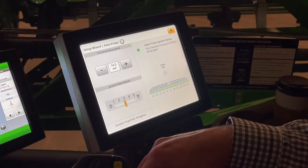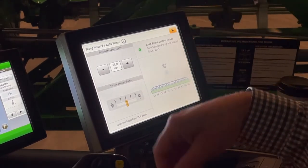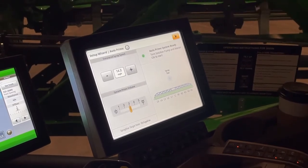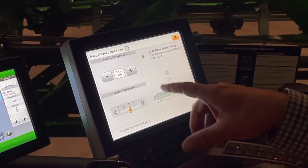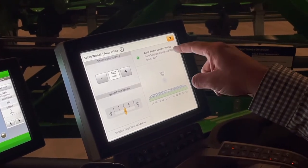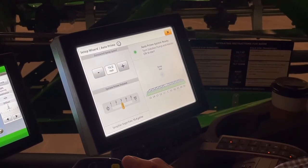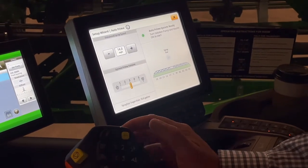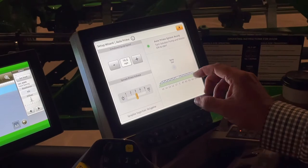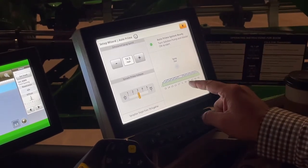This is replacing your manual charge where you just pull into the ditch and hit spray until you see product coming out of all of your tips. Once I have done that, I'm going to turn my solution pump to on and hit my master spray on my hydro handle. Once I do that, my entire boom will light up and it'll actually be spraying out the back.